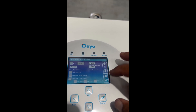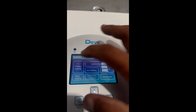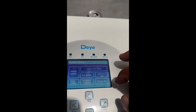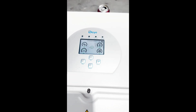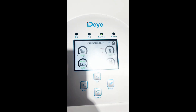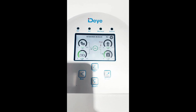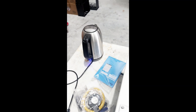With that DRM setting turned off, the inverter should now actually work with just the battery connected. The inverter now has the normal light on. I'll go and turn on the kettle — the kettle's now working, and we can see it's drawing 2.06 kilowatts out of the system. The battery is now providing load to the inverter.